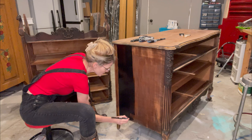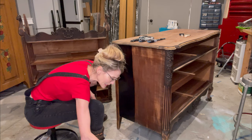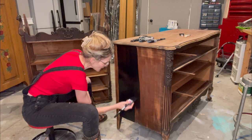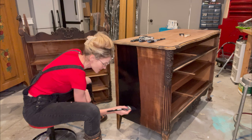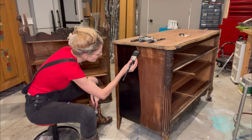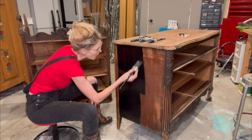I also will very lightly feather-sand in between my paint coats if need be — if the paint got globbed up in an area or I feel dust nubs. You don't want to burn through your coat of paint, so super light. I usually do it with either 400 or 600 grit around a felt block. That's how I sand in between coats — and that's a great trick to get really smooth finishes. Sometimes you don't need it; it all depends. But as you can see here, this brush performs amazingly.